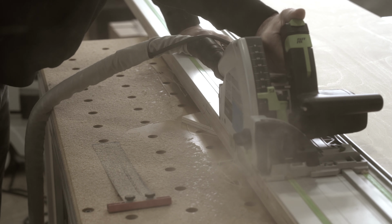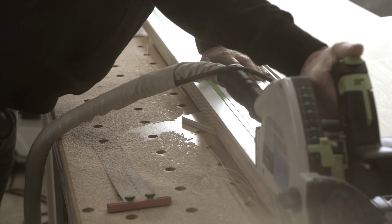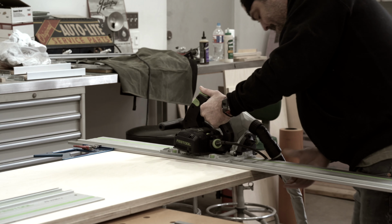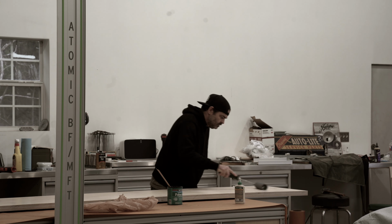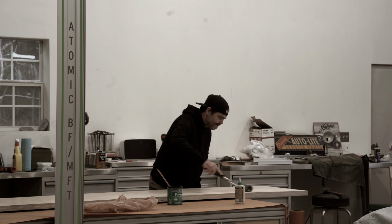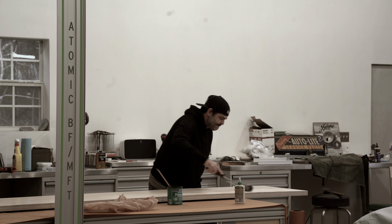The next day I cleaned up the edges of the top by cutting it down to final depth and cutting it closer to final width. Then I went ahead and applied a finish to the bottom using 4 coats of poly hastily applied with the roller, sanding between each. I honestly didn't care about the finish quality at all, but it turned out surprisingly well.